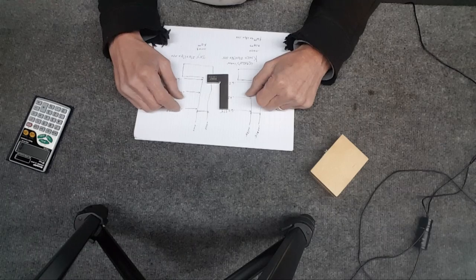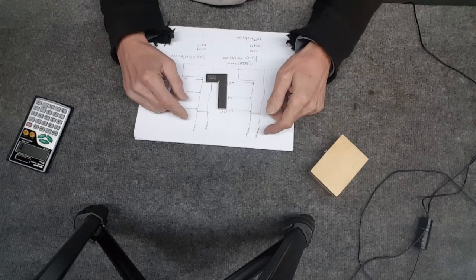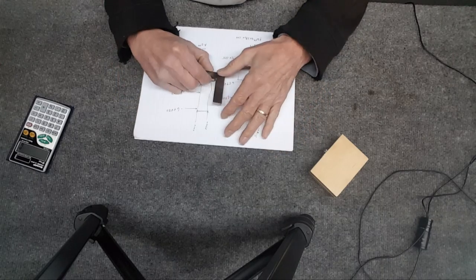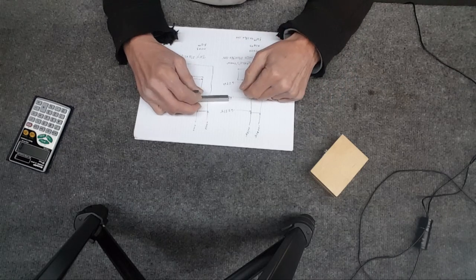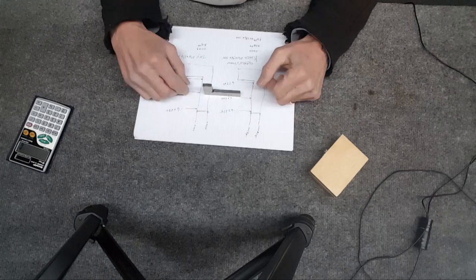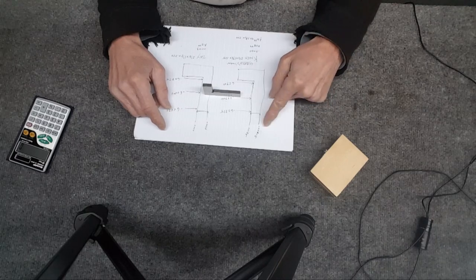So next up, I'm going to show measuring the parallelness, and then after that, how I decided to actually check to see just how square this guy is. Both of these guys too, when I put it on the granite surface this way, with the light behind it, you could barely see any light coming through the edge at all.